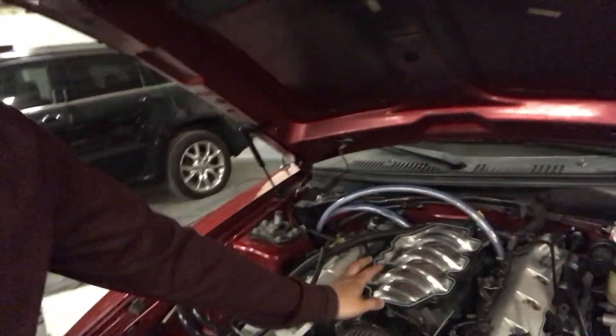Welcome back — today is a really exciting day. We're going to start the air-to-water intercooler. This Mach 1 or '99 Cobra — basically the 4.6 four-valve engine cars had that intake manifold — but we're going to adapt that to a custom air-to-water intercooler I'm making for the turbo setup, so I can use a Holley high-ram on top. Should make for really good flow and cooling capabilities.